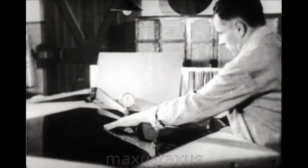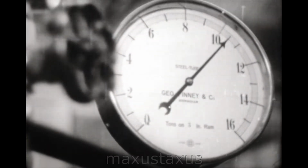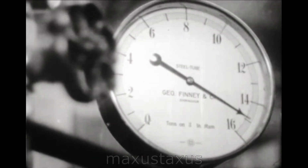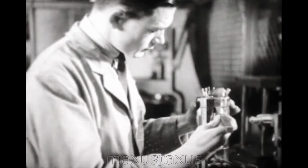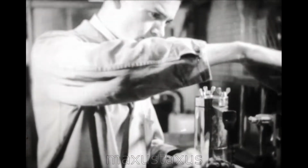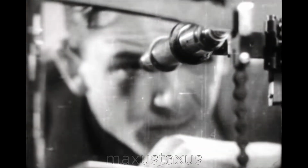Uniformity of thickness is quickly ascertained with the aid of an indicating micrometer, while the ability of the material to withstand crushing stresses is established by a compression test. Laminated sheet material is employed in the production of gears and gear wheels, which necessitates that it should be resilient and highly resistant to bending, and this is controlled by a special testing apparatus where weight is increasingly applied by metal shot.